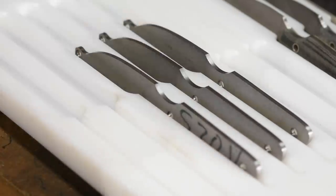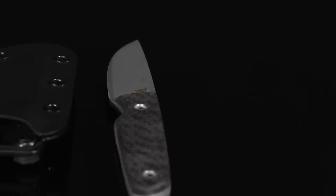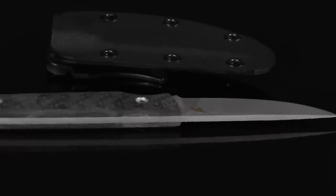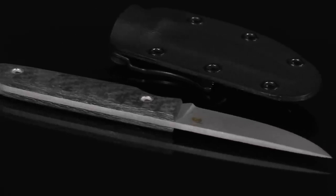Let's talk first about how knife handles are attached to blades. Most modern blades are what we call full-tang knives, meaning that you can see metal all the way around the handle. The scales — those are the handle pieces — are stacked or pinned or whatever on top of that, sandwiching the metal in the middle. It could be a screw, could be a pin, could be other things, but we'll need to take those off and then put the new one on.